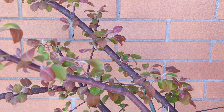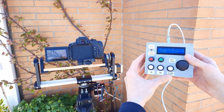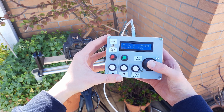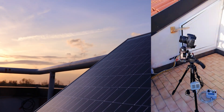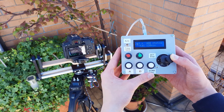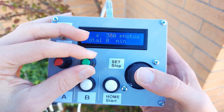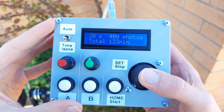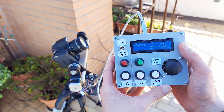This mode is very useful for taking shots of objects with very smooth and precise movement. Timelapse mode is for making timelapse videos with the camera moving a little bit with every shot, to get a really nice effect once the frames are put together in a video. Here again we set the start and end positions of the movement, and with the 2 potentiometers we set the total number of photos and the time between the photos. All we have to do at this point is to start the timelapse on both the robot and the camera.